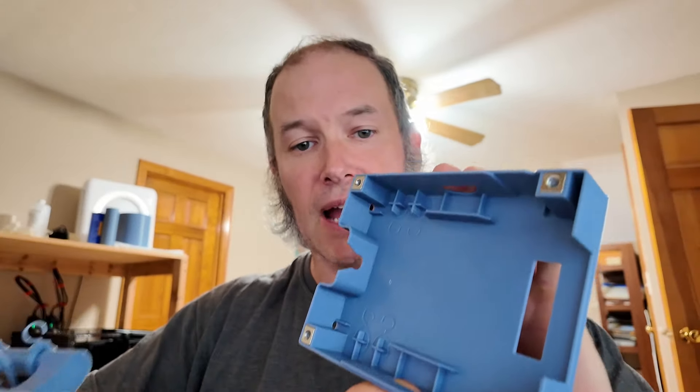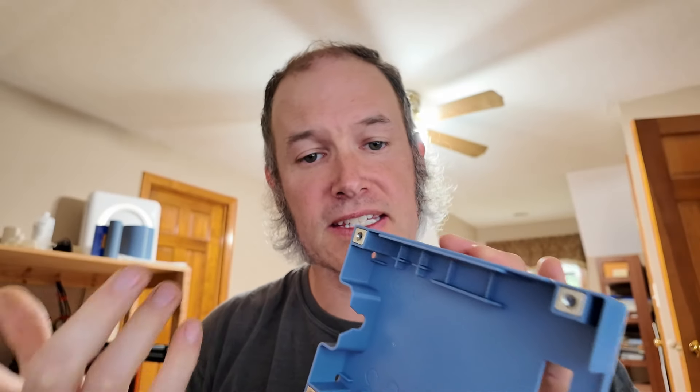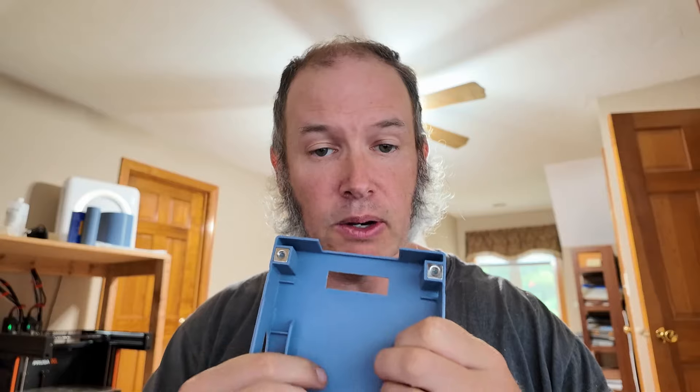After that we figure out where all the plastic goes into the different parts of the molds — for example, would you rather have your injection points on the outside or inside of parts? Typically I'll try to hide the injection ports on the inside of parts where they're not as noticeable. Sometimes you can't do that, but if you can, it's better to place those areas on the inside where they're less likely to be noticed. You also have to design plumbing for all of these blocks — the gates that control how the plastic comes in and goes out. That's really complicated and a big portion of the mold design. However, the company I use has common blocks that attach to the bottom of your mold and control all of the valves for plastic flow. It's not as flexible, but it is much less expensive.